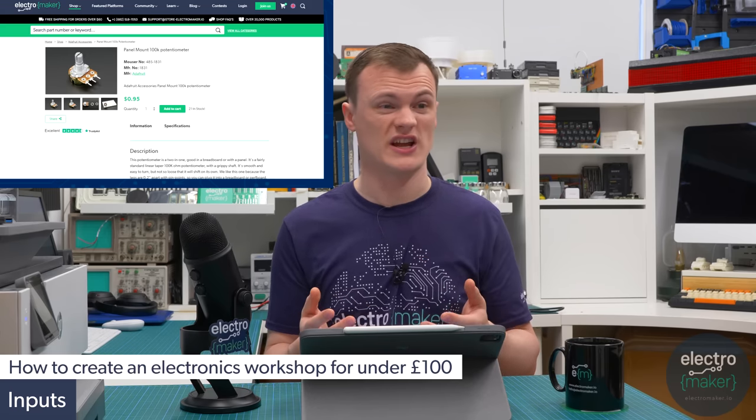Finally for $4.88 is a 16x2 LCD. They are quite antiquated now and not really the display you'd commonly go for in a small project, but there's something nice about them that I personally use a lot. They're big, easy to read, very commonly seen on vending machines, easy to program, and you can get I2C versions that only need four pins: power, ground, data and clock. They add a bit of a retro feel and I think you'll have a lot of fun with them.